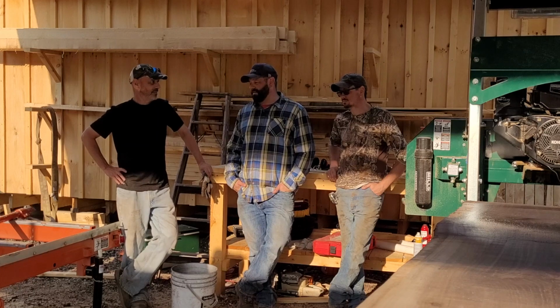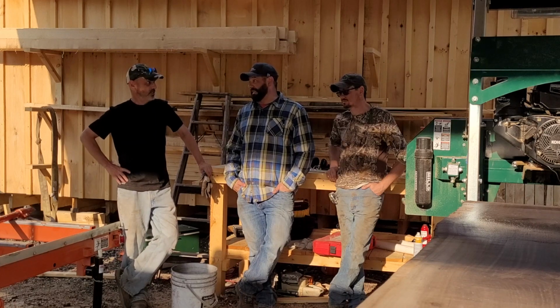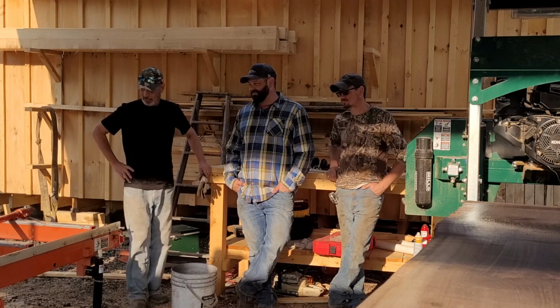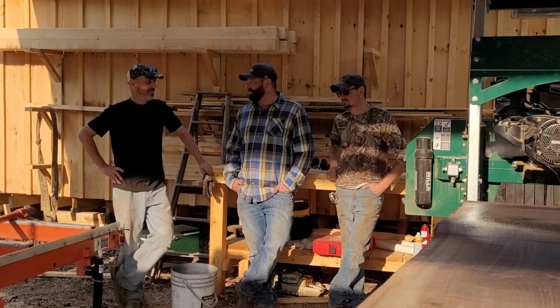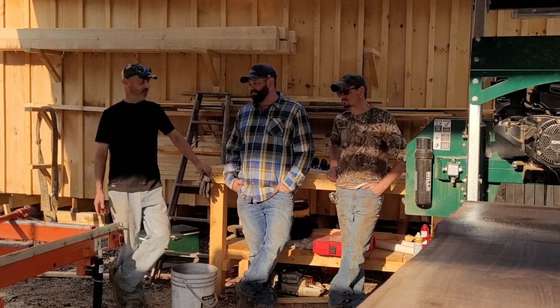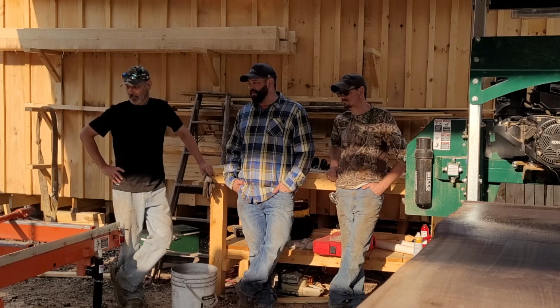The toe boards work. They do. That was a heavy log. That was a 3,600-pound log. We lifted it from 3 feet in from the end. So, I mean, that toe board worked. It did 1,800 pounds. Yeah. If you're doing an 18-inch log, it comes up and down. It's no problem at all. So that was probably pushing it.